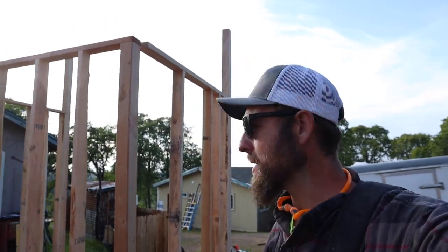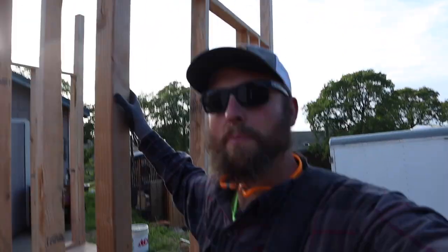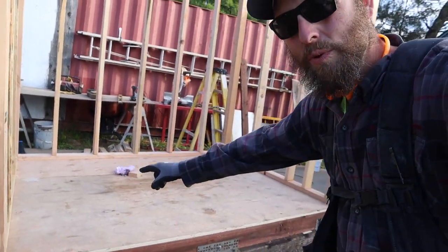Well, I think that's enough for today. Got the three sides up. Only thing I gotta do now is just put my double top plate up. For the next video, we will work on the front entryway here. A couple windows and a door.